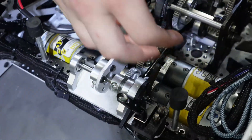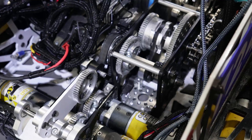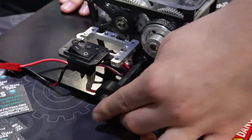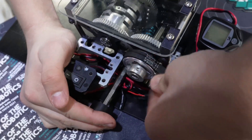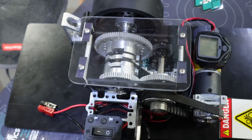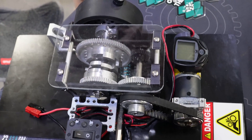The extension is powered by three motors in the front that go through the gearbox. They chose the gearbox because they need high speed during the actual game, but for the hang they need a lot of torque. So they actually shift to a one-to-five ratio. There's a shifter that shifts between the ratios — the two gears are always in motion, and shifting makes whichever gear you select active on the actual axle, changing the overall ratio.